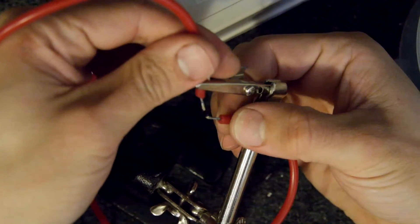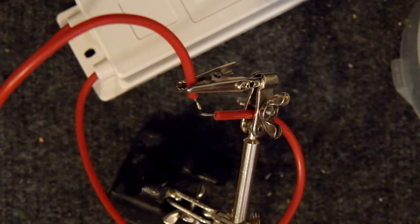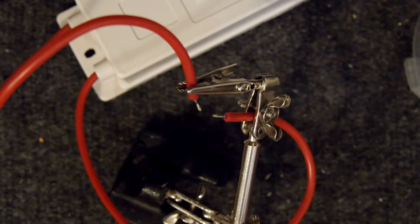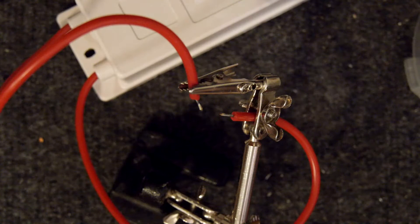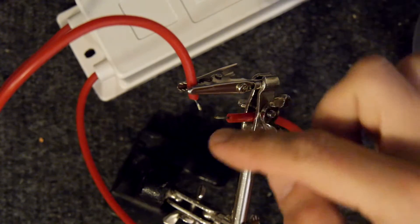That's pretty much an arc. The wires and everything are really quite hot — it's obviously a lot of energy there. I've opened up the gap now, made it double. That's double the gap. It's like five mil now — nearly a centimeter. You can see it arcing back on itself at that point. It's actually arcing back and then through the metalwork of this.